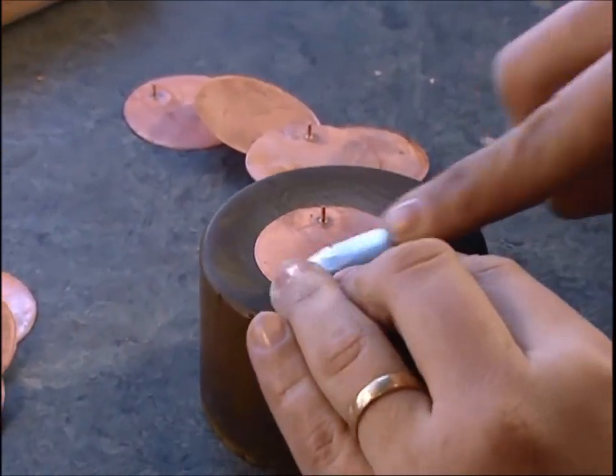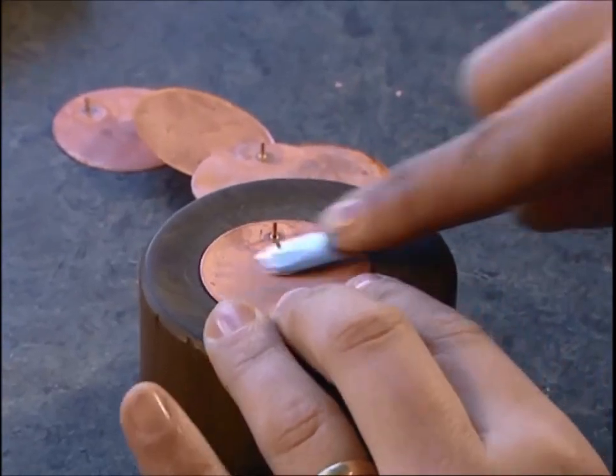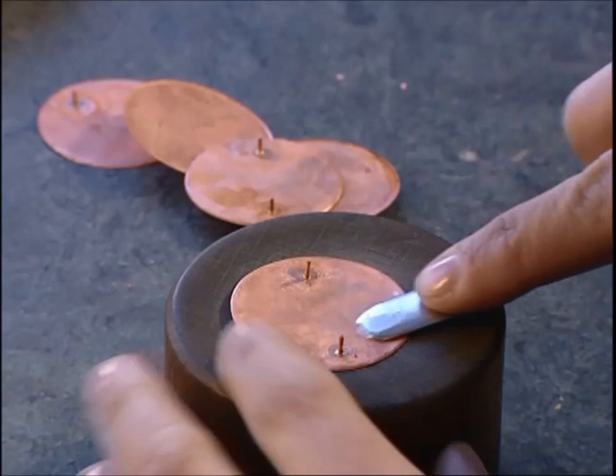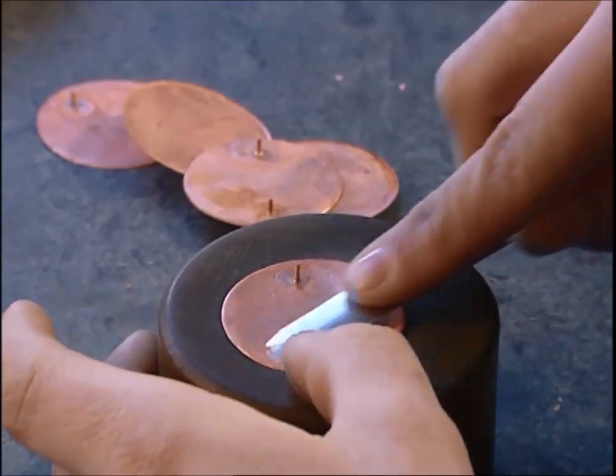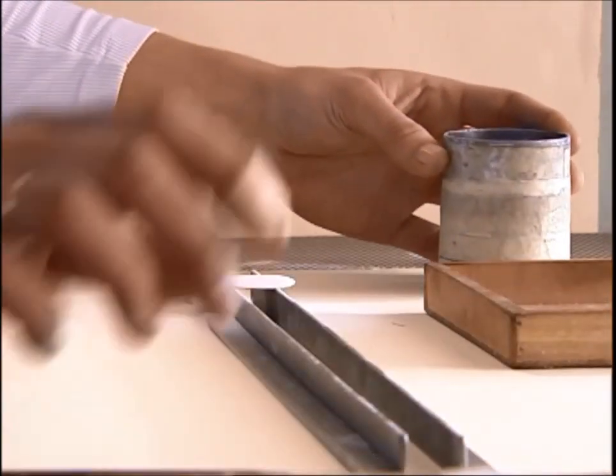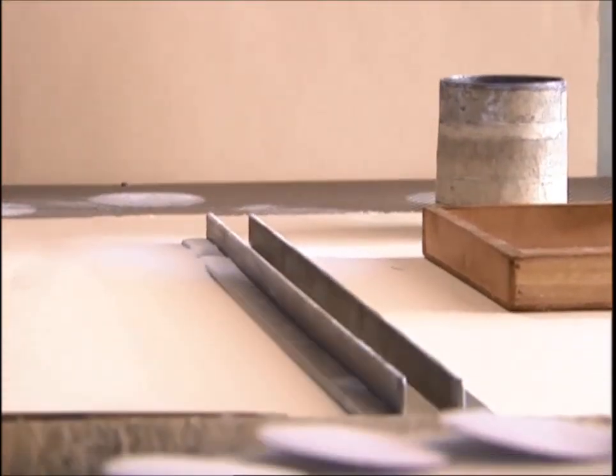After manually riveting its two feet, the copper plate is cambered by accurate, dexterous gestures to enable it to stand up to the traction it will undergo in the furnace. The finely powdered enamel is applied to the copper plate using a fine sieve before being fired to vitrify the enamel.